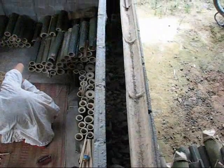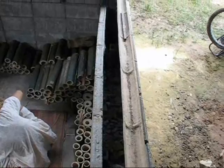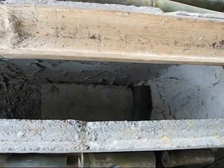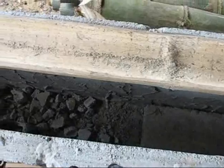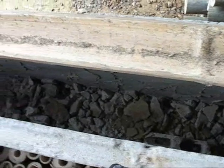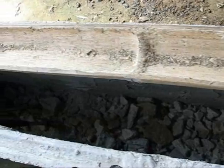So all the walls I've shown you are actually two walls, or double wall cinder block thingies, which is not the normal Thai way of doing things. What I do is I put a space in between the two walls because I don't really think those cinder blocks are very strong. And then I fill it in with sand. In this case, I'm waiting to fill it in because I have to put some wires in there for some switches or something.